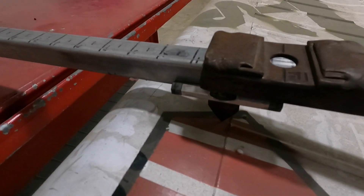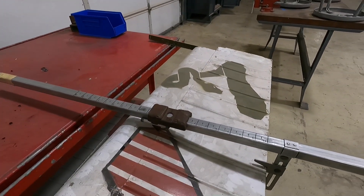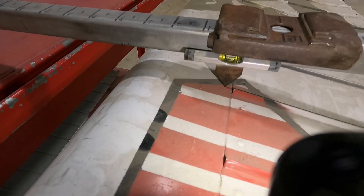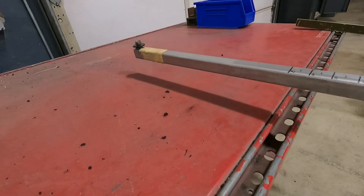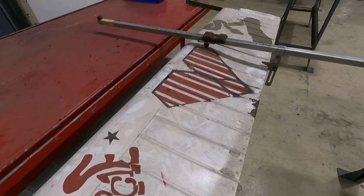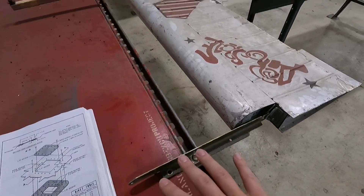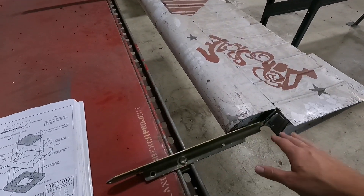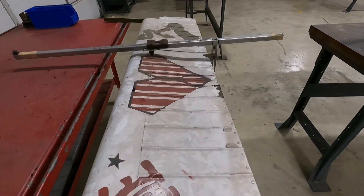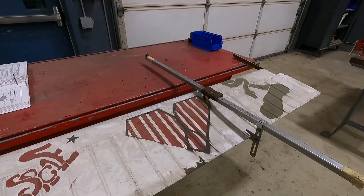I just had to move the weight forward just a little bit. Let me get a light on that bubble level — I want you to see the bubble level. If you can sort of see, the bubble is centered. The front of the arbor isn't touching the table. Everything's leveled. You've got to make sure that your knife edges are level — you want everything level: the table level, the arbor's level, your hinge points level. When everything is level, you'll know you're in balance. If the arbors are crooked or it's on an uneven floor, you're going to struggle to get an accurate reading.